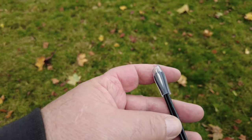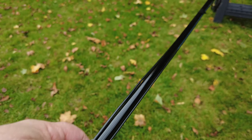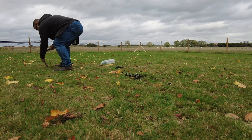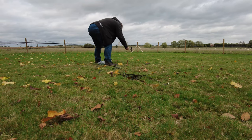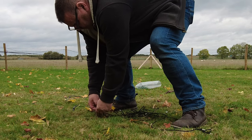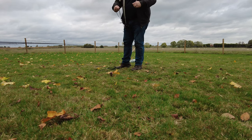Here's the 80-meter element going to the little double eye — use the 5-meter point, not this one. Use the double eye for 40 meters and 30 meters only (30 meters if you're not doing 80). You get a choice with this antenna: 30 meters or 80 meters. If you go via the ATU, you'll still get 30 — but this antenna shouldn't need an ATU. For guying, take one large step from the imaginary center, 120 degrees apart, for three guy points. Any metal stake will do — from a camping shop or cheap angle iron.